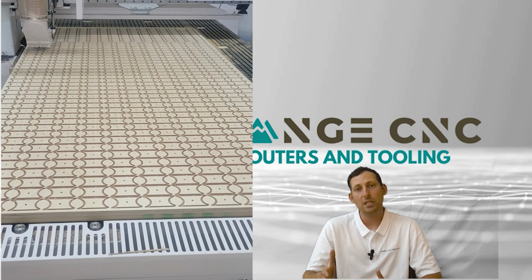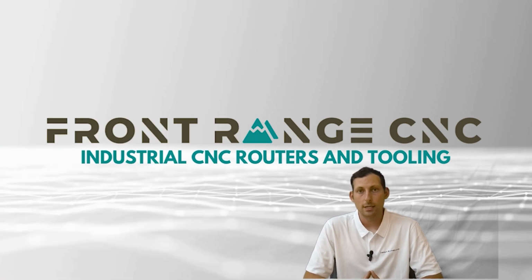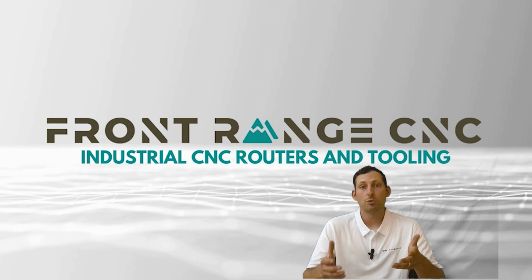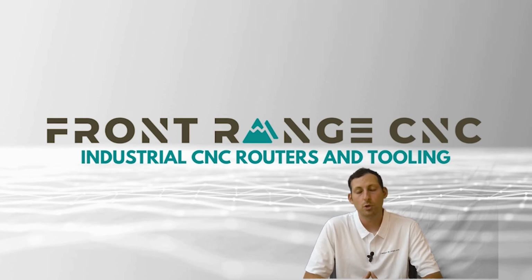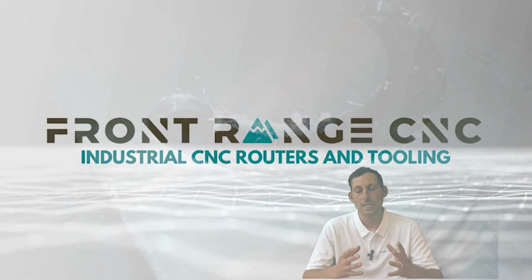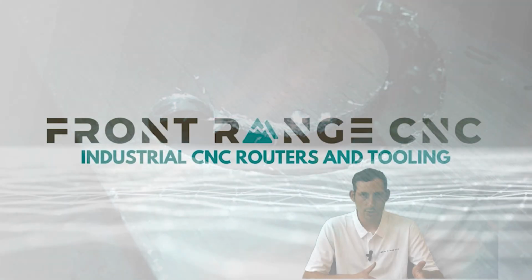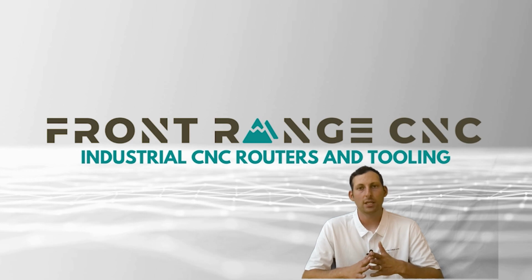A down flute typically is very bad and really the wrong choice if you're doing aluminum or plastic, simply because those materials have a tendency to produce significant amounts of heat, and the material can then melt either to itself where you just cut or to the router bit that you were using to cut that material. And so in plastic and aluminum, a down flute bit is pretty rarely used, especially in router applications.